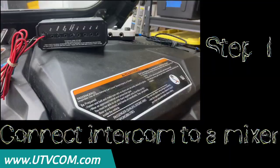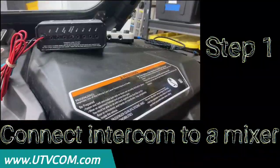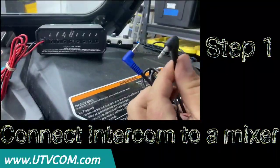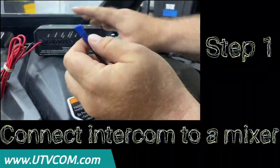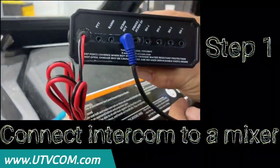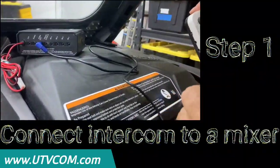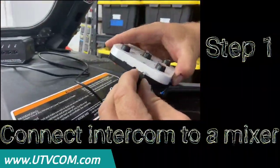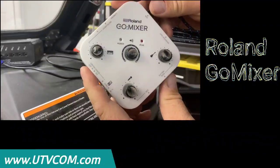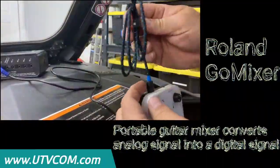Okay, to turn your intercom into the mic source for your videos, what you're going to need to do is plug a 3.5 millimeter male-to-male extension cord, one end into the audio out of the intercom, and then take the other end and plug it into the line in on the Roland Go Mixer. So it's right there on the line in. And then the Roland Go Mixer has a cord.